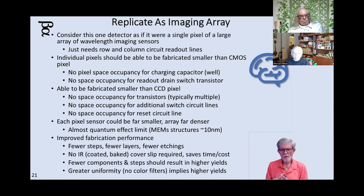Because there are fewer steps in making the integrated circuit — fewer etchings, no coatings to bake on — simpler saves time and cost. Fewer components mean higher quality and higher yields. You don't need the extra filters, so every pixel is identical — you don't have red, green, and blue pixels; every pixel is literally identical. Greater uniformity, greater yields. If you get the right people interested, it's kind of a no-brainer.